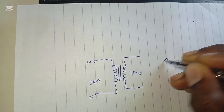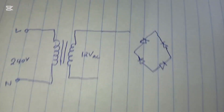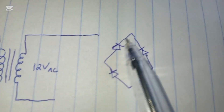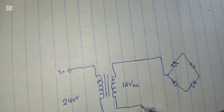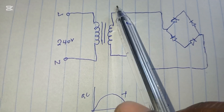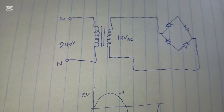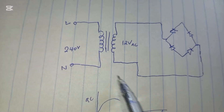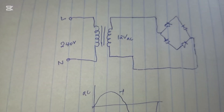Let's first use the bridge rectifier — it's very important. This is how a bridge rectifier looks: four diodes connected in a bridge. We connect it to the system. When this side is positive, the current will come through and pass through this diode and continue. When it returns, it returns at this point and goes back to the system. The full video explanation is in the description. At this point here we will have DC power.